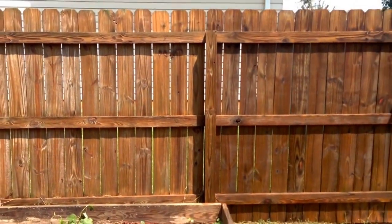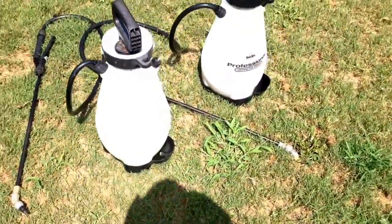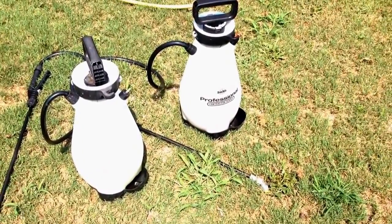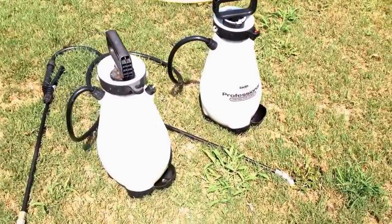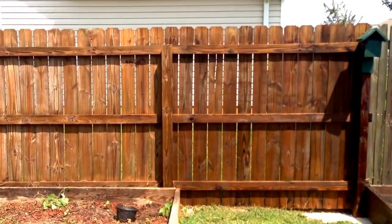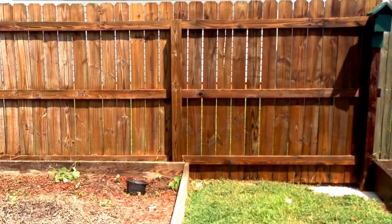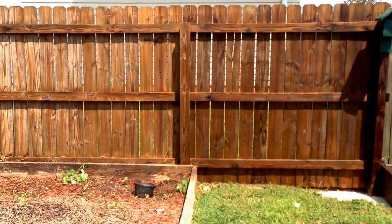A couple notes on application and pump-up sprayers, mixtures and all that. I did mix these in two different pump-up sprayers. Hydroxide does have a lifespan once you mix it together — you don't want to go mixing it the night before. Day of, I believe Charlie told me about eight hours — you want to use it within eight hours. Obviously hypochlorite, we all know what it does. So that's a good look at our step two completion: we pre-wetted, then we applied our soap, then we pressure-washed it off. Our fourth step is going to be to apply oxalic acid at 3 ounces a gallon. You really want to mix these powder mixers with hot water — today I did not use hot water, but I'm only mixing small batches.